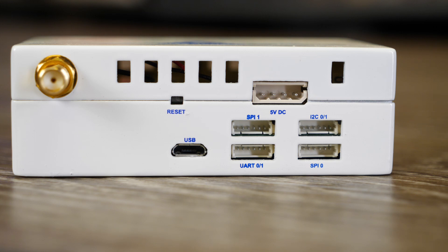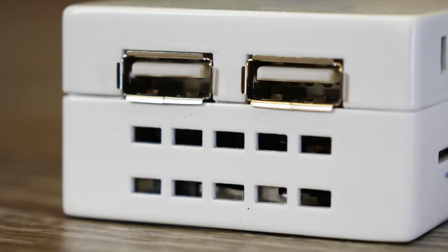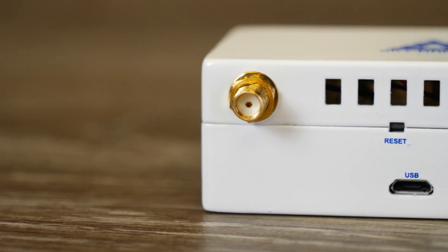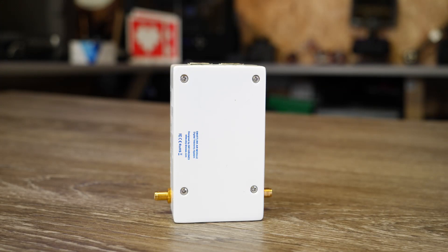Above the ports is the 5V DC input. The SPI and UART ports allow connection to your autopilot for telemetry data and also let you connect additional sensors directly to the air unit rather than routing them through your flight controller. Around the back are two USB-A ports for connecting external devices to the onboard companion. On each side are SMA antenna connectors, and on one side at the back there's a fan to keep the electronics cool. Underneath there are no connections — just conformity labeling and mounting points for attaching it to your frame.